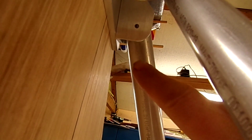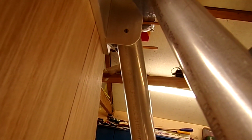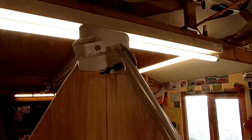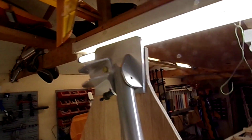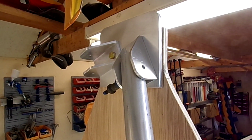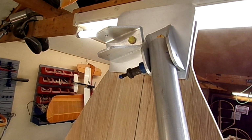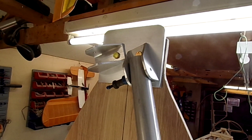So what I'm going to do is get this piece of pipe work out of the way, just rotate the bracket up, and drill a 4mm hole in there, and put a gripper pin in, and I'll do a 4mm hole from the other way. So drilled through 4mm, held in place with a gripper pin, and just drilled up there 4.5. I'll put a 4.5 drill just to act as a guide to hold that in position, and I'll enlarge the lower one, take the gripper pin out and enlarge the lower one to 4.5. Then I'll just run a reamer straight through from one side to the other at 3/16, 4.8mm.